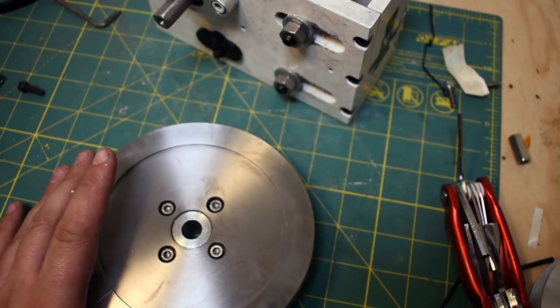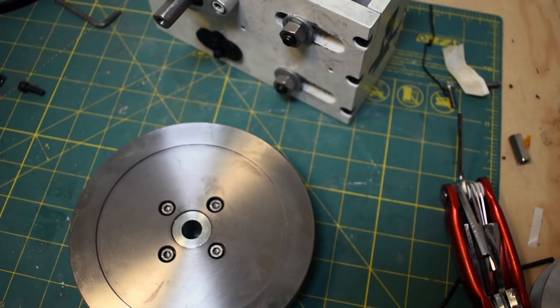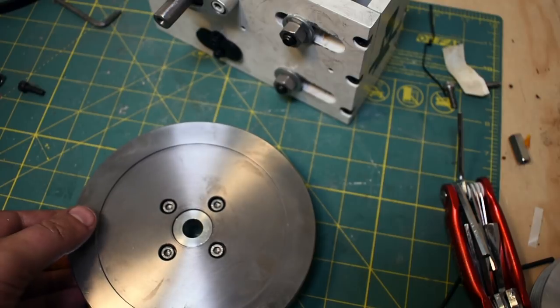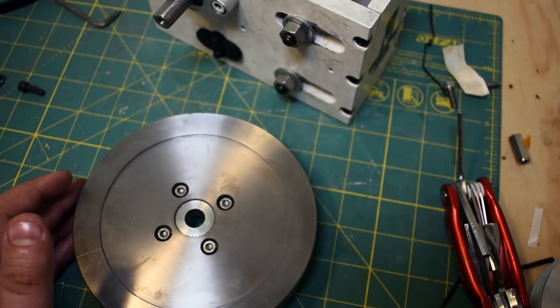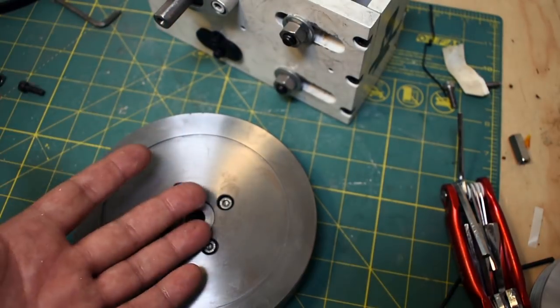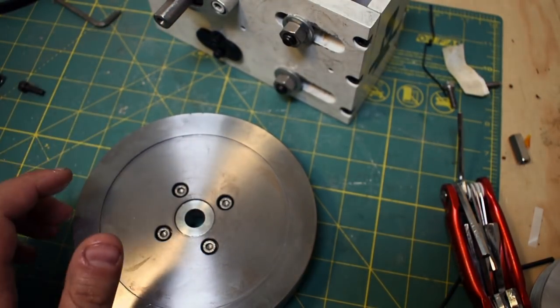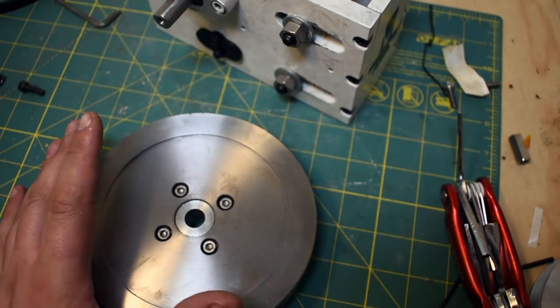You'll also recognize flywheels from vehicles. In a four-stroke engine, the cycle is suck, squeeze, bang, blow. Ugh, demonetized. The energy only comes in from the bang, so the flywheel actually has to carry the mechanism through the other three stages. So that's what a flywheel does in that application. In this application, you're only crushing rocks for a small part of it. The flywheel charges energy when it's not actively crushing rocks and then dissipates it when it's crushing rocks. It's kind of like a capacitor, but mechanical.